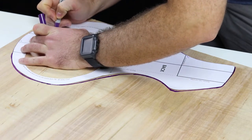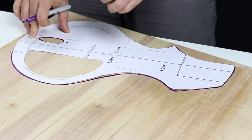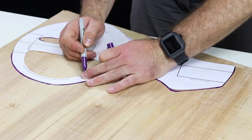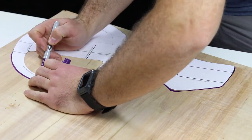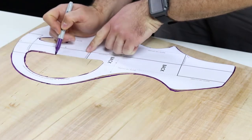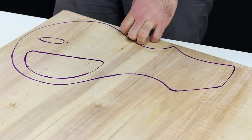Because we just need to do the output jack and I'm gonna peek through the holes that I drilled for the screws there so that I know where the screws go in case I want to expand that a little when I cut it. I want to make sure not to get any closer to the screw holes, or else you won't have any material to go into. And cut out this cavity cover. I should have taped this edge because it's kind of flying up on me, but that should be good enough. So again, I don't even know if that's accurate. So what are you gonna do?